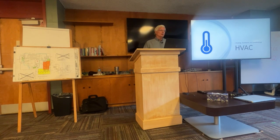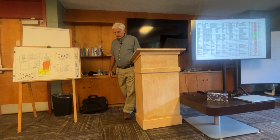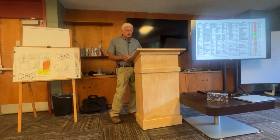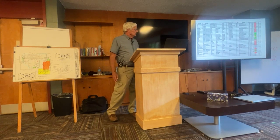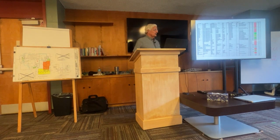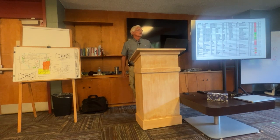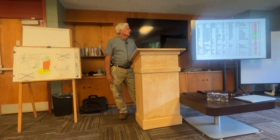Let's go into some of our building systems. The first is our HVAC system. This is a spreadsheet our maintenance folks — TP Mechanics — put together. The red line indicates all devices that have exceeded their useful projected life according to manufacturers. In phase three we gutted all our air handlers, put new bearings and motors in them, but the boxes and fans are the same.